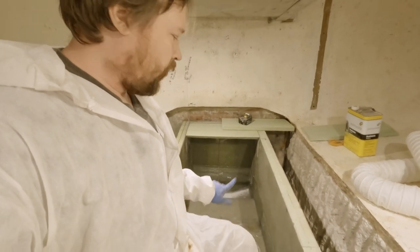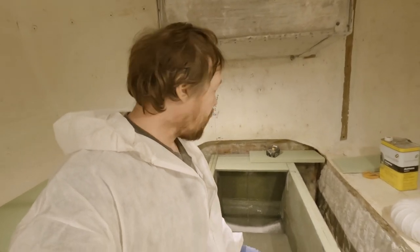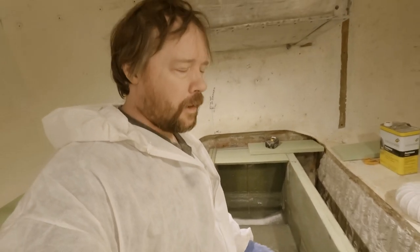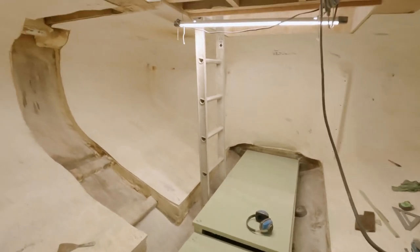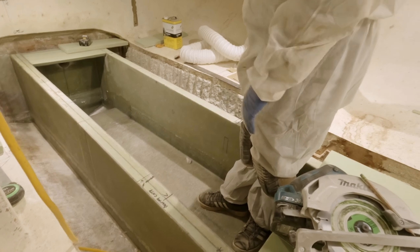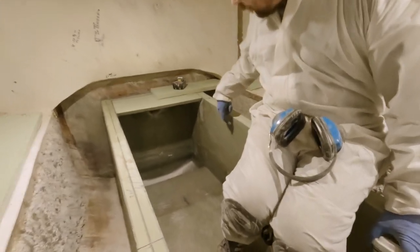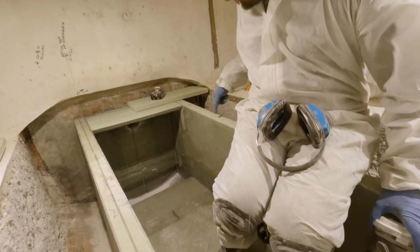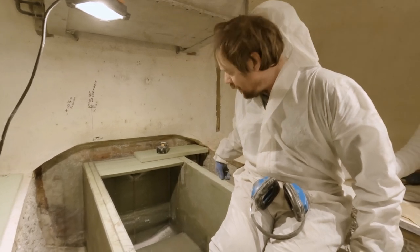This thing will hold a lot of water in here so you really only need to pump it out occasionally. When you're out fishing you just check it every day - if you have excessive water you're going to know about it, and it's just good to keep it dry. In town you can just monitor it and come down and pump it out every week or so. All right, so we're just about to notch these stringers out right here to receive this cross brace. I just have it marked out - I'll cut a 45 in there, and then I might have to come in with an angle grinder because the center web kind of makes it tough.